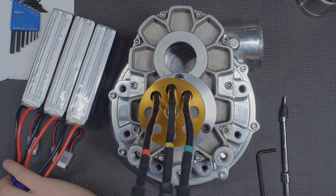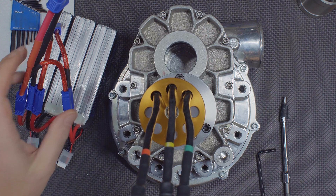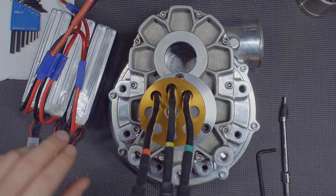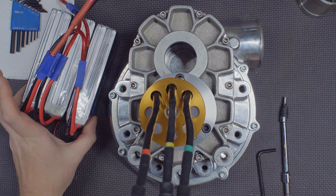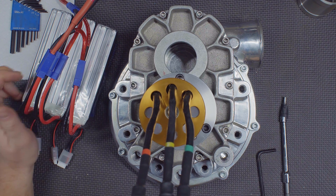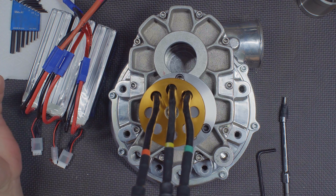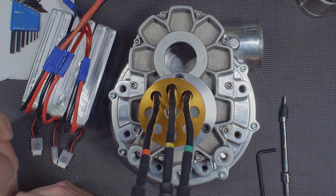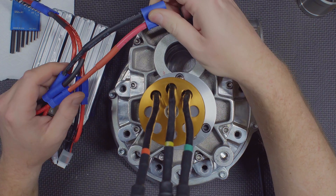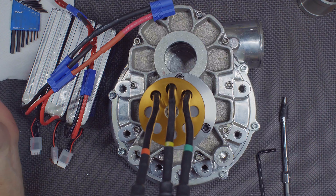I'm happy with the batteries, not so happy with the cables. Just look at this mess — what are we going to do in the car? Is this going to be flying around like scorpions in the mail? No. I've got to make some kind of housing, and I have a game plan that both makes a housing and eliminates most of this wiring. The battery cables themselves are still going to get warm — there's not much we can do about that. Shorter cables mean less resistance and more current capacity. The 8-gauge section of my cable contraption was not even warm; it was the 10-gauge stuff that really couldn't tolerate that power.